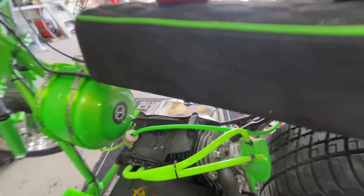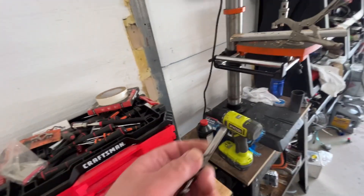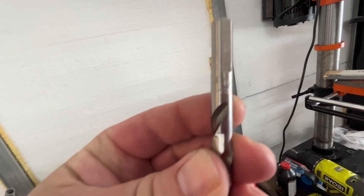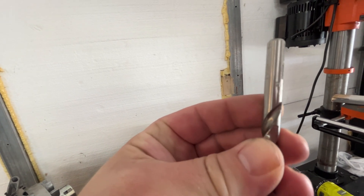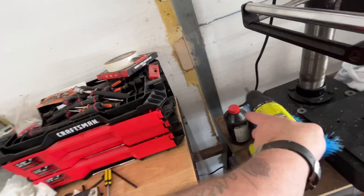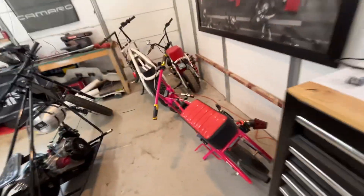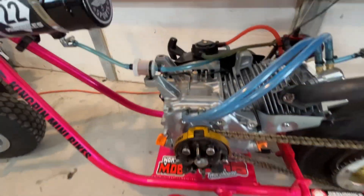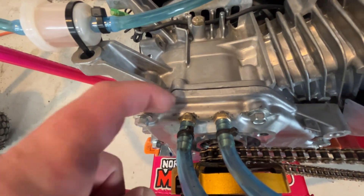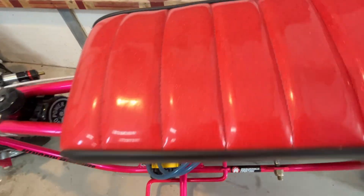It's really simple. Just get the Amazon tap and die set, or use tools you have at home, but most people don't have this. It's a 21/64th drill bit for the 1/8 NPT tap. The fittings you're looking for when you go to set these up is a 1/4 barb — that's the barbed part — with a 1/8 NPT male fitting, and you'll need at least four of them.